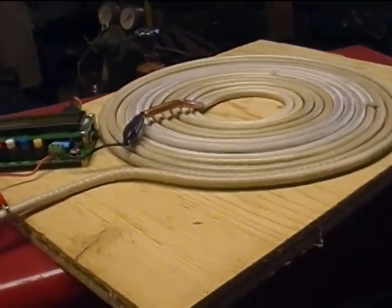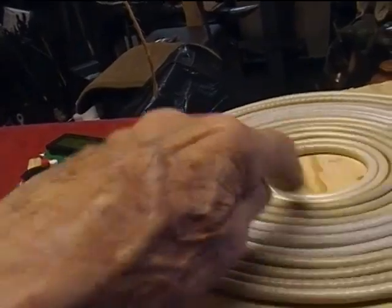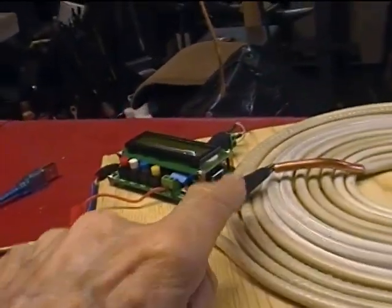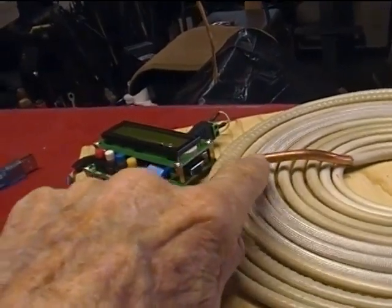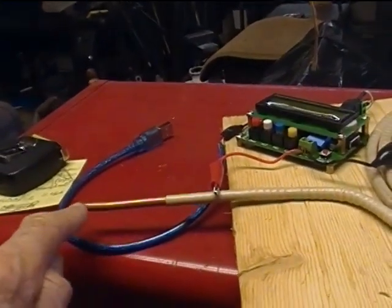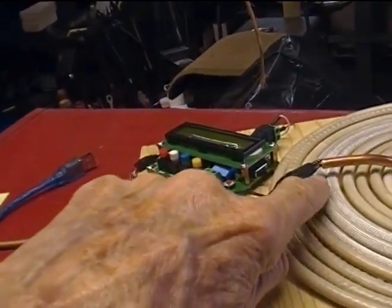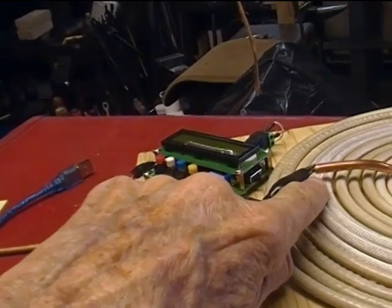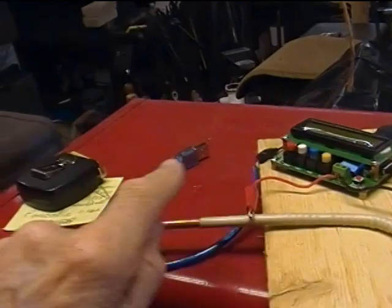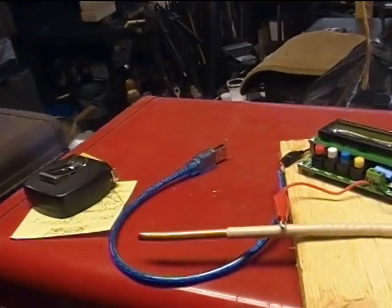When I made it, I just kind of started at one end and hand wound it to the outside. I don't have enough tubing here to match up with this, so I'm going to swage a piece of copper tubing of the right length so I can attach it right on there with soft solder. Then I'll be able to hook up my normal compression fittings to an induction heater.